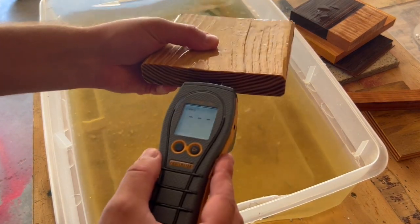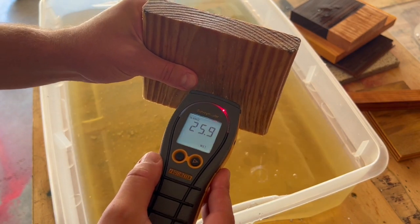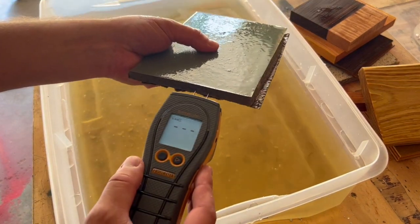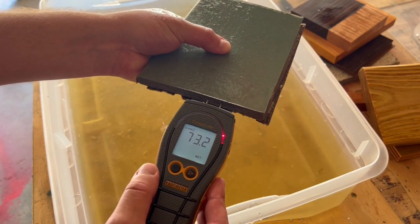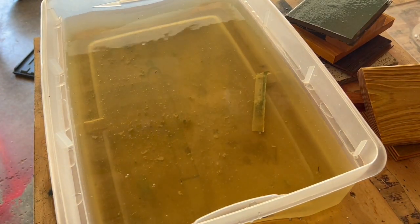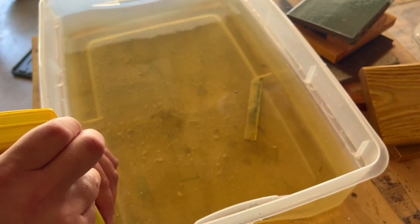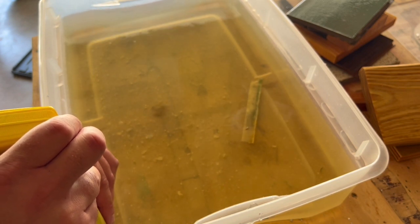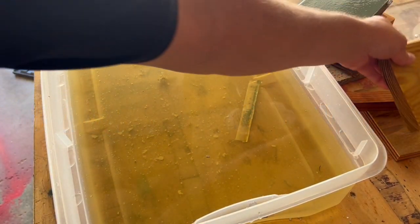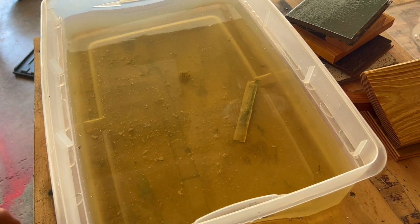PT decking board: 40 — not bad on top. Good for the deck board. And the green board — oh, the paper's coming up. It's going to be 100 — 73, 70. Let's see how much water got absorbed: three-eighths inches of water ended up in all of these things. So we're going to dump this out, let them dry, and do another moisture comparison in 24 hours.